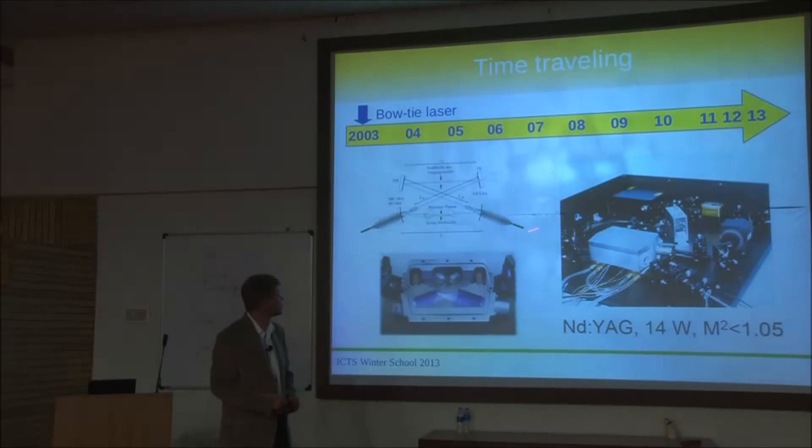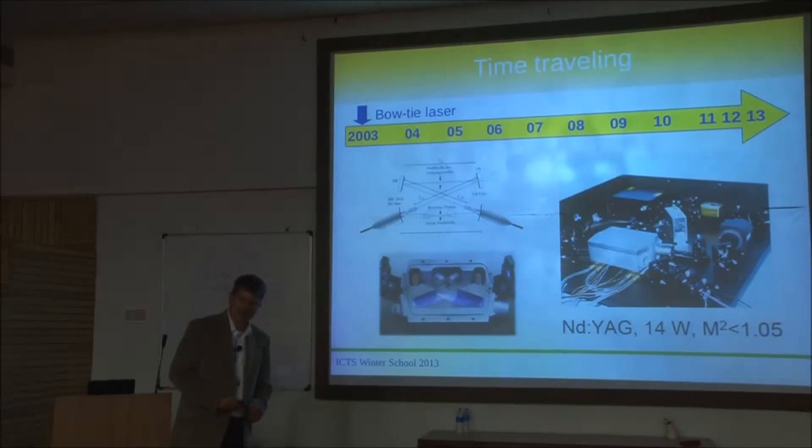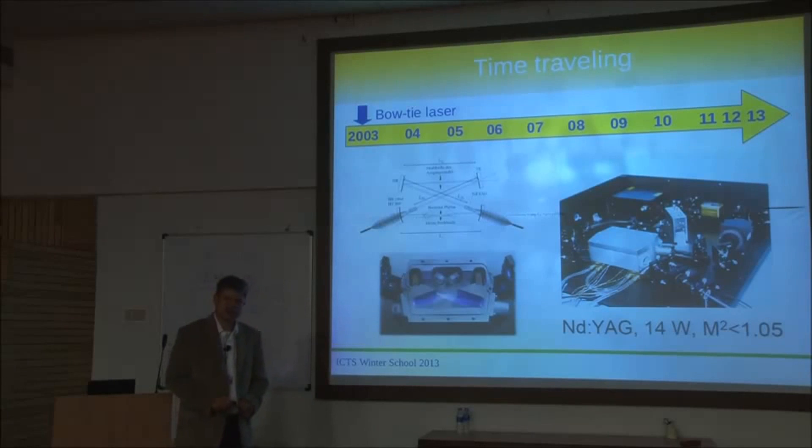Here are the first pictures from the very early years. The bow-tie configuration has neodymium-YAG crystals in copper-cooled heat sinks, longitudinally pumped, with a ring laser producing two output beams. The overall setup was an injection-locked system — an NPRO whose beam is fed through an EOM and a Faraday isolator into this bow-tie configuration. That's a 14-watt laser that was used in GEO as a light source.